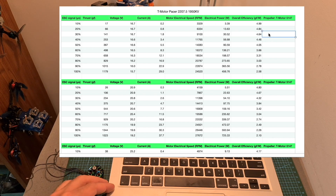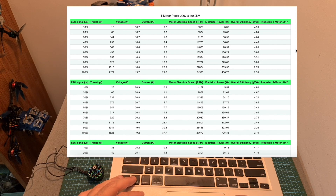So the result that we are getting is the grams per watt, a value that can help us compare the motor using different propellers and also using different batteries. Thrust tests are important because they are going to help us identify the equipment that we need to use, and also check if the motor suits our needs in terms of performance and efficiency.